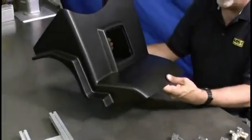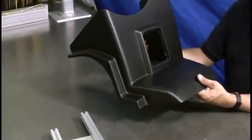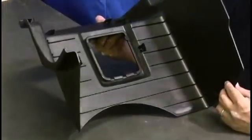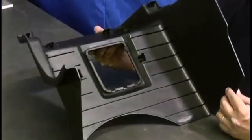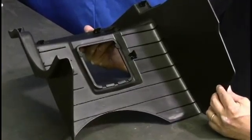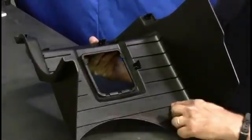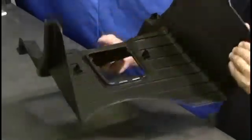The first step in preparing to build an end of arm tool is to look at the details on the back surface of the part. They will show you the direction of the die and the direction the part is demolded. Notice the straight ribs run in this direction, meaning the part will come out of the mold like this.